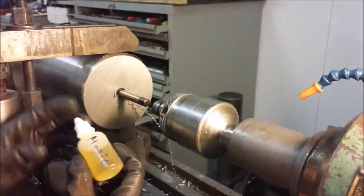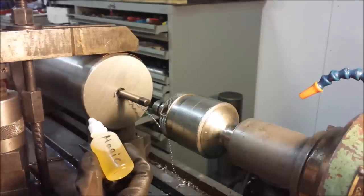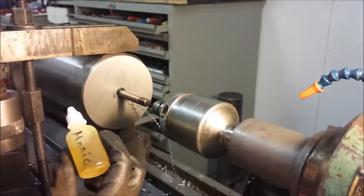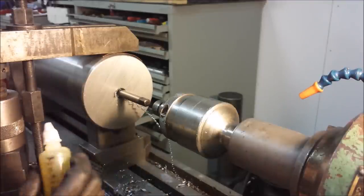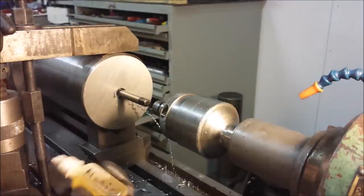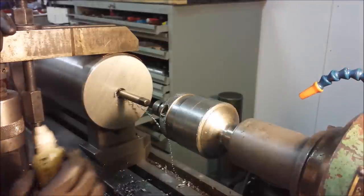The thicker one, when it gets warm, it will distribute for a longer period of time when you're tapping. So I prefer the thick tapping compounds, but this seems to be very nice. I haven't tried the Rapid Tap yet, but this was the Tap Magic, it's called. And yeah, it smells wonderful.